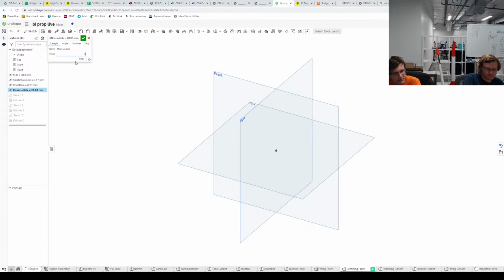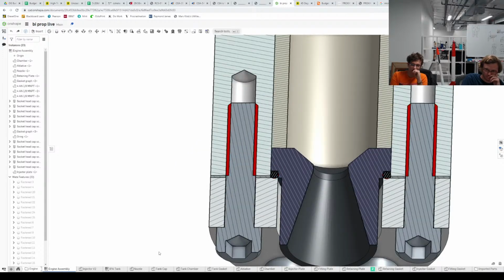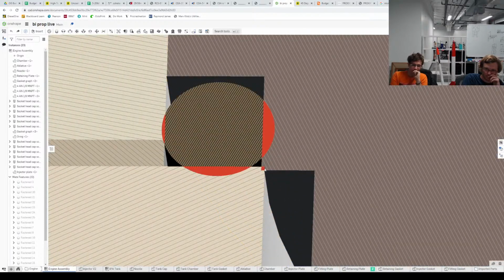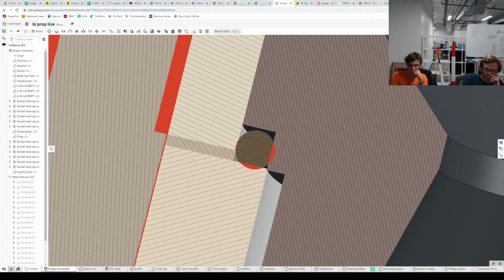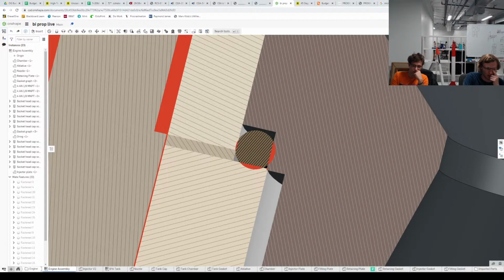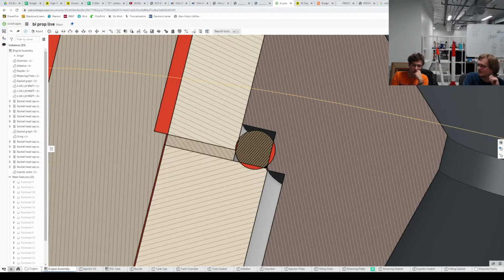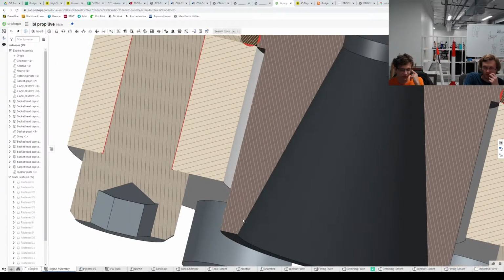How easy are those nozzles to sand? Well, we've got to find a drill bit to get to that size. No, I'm just saying we can undersize it and then just sand the nozzle. Undersize what, though? The hole size. You make it smaller than it's supposed to be, and then we just sand the nozzle down. I understand, but how do we get a drill bit that's exactly that? There are drill bits that are 20.65 millimeters. Well, you find a drill bit as close to that number as you can get, under that number, and we'll sand the nozzle.